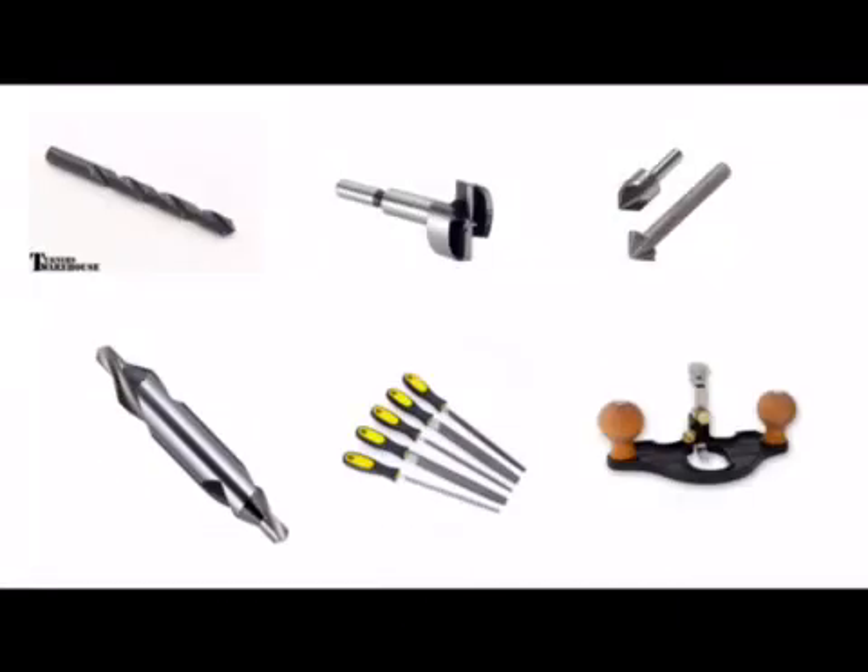On the next screen we have examples of different drill bits. We have a twist drill — used for drilling holes in wood and metal. We have a forstner bit used for drilling bigger diameter holes in wood. We have countersink bits used for countersinking the top of a hole, whether it's been drilled in wood or metal — the top one here is for metal and the bottom one is for wood. We have a centre drill which is used in a metalworking lathe for centring the end of a piece of metal prior to drilling it on a metalworking lathe.